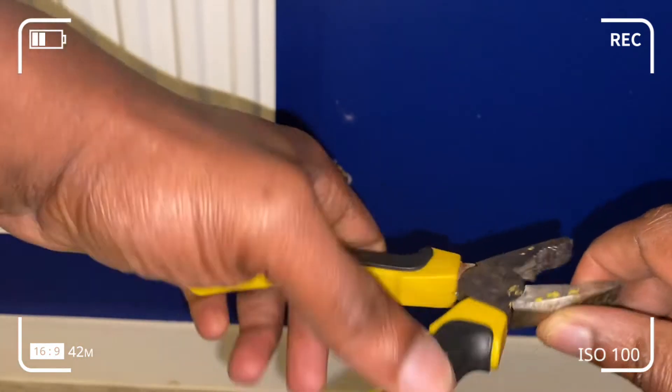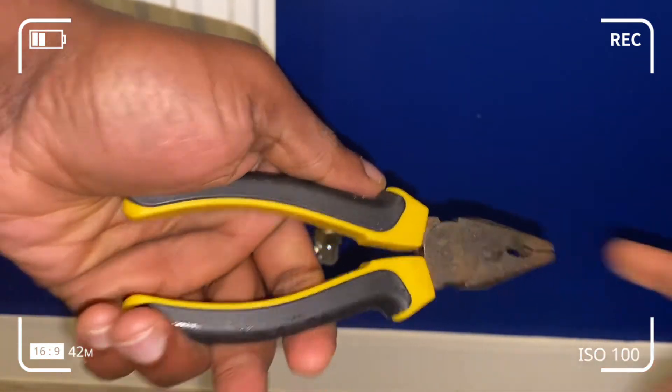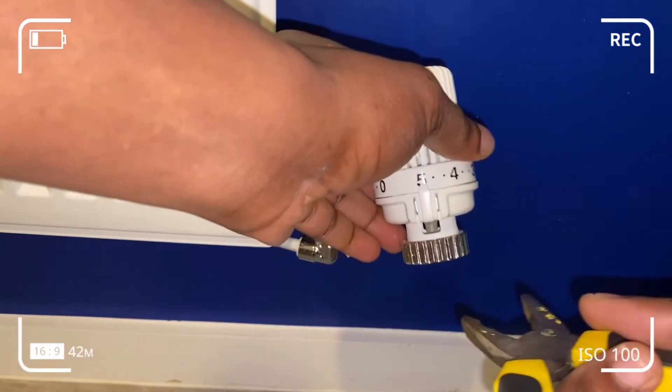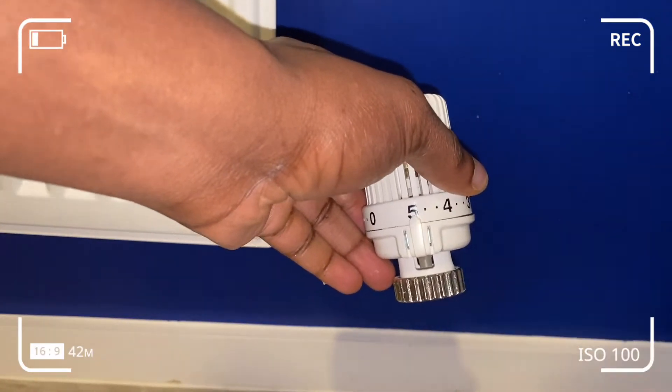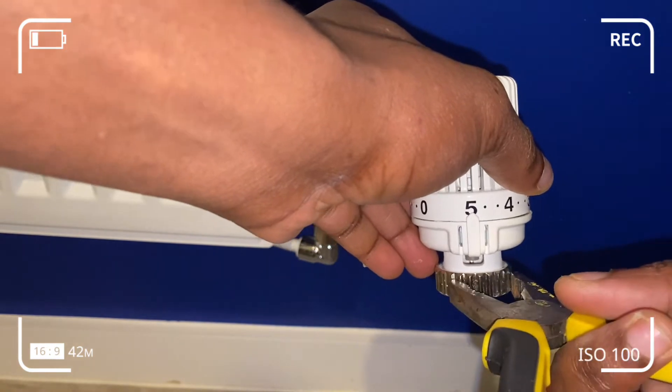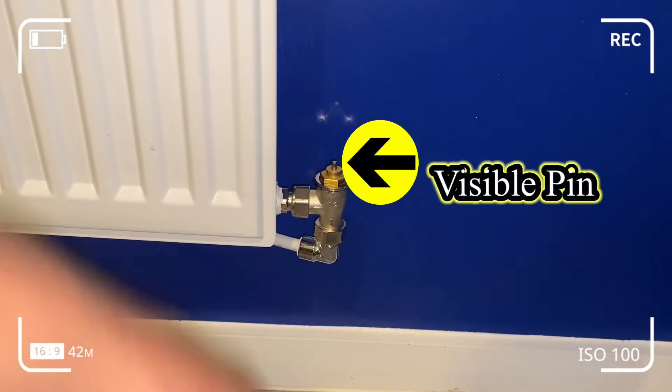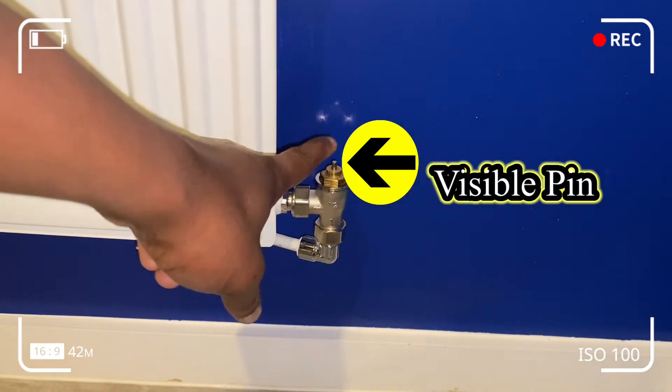You can improvise here — just use anything that's quite sturdy. You can use your pliers, a bread knife, or a piece of metal, as long as it's got enough force to move the pin in the perpendicular position. If you've got the locking ring quite tight, you could use plumber's pliers, grips, adjustable spanners or wrenches to get off the locking ring.